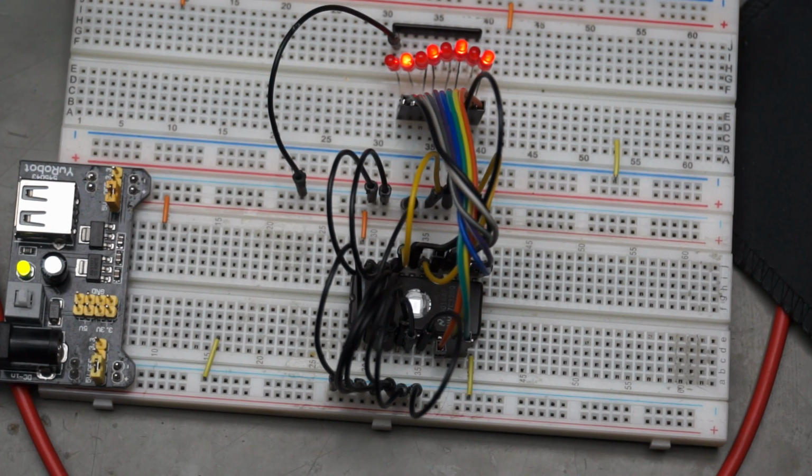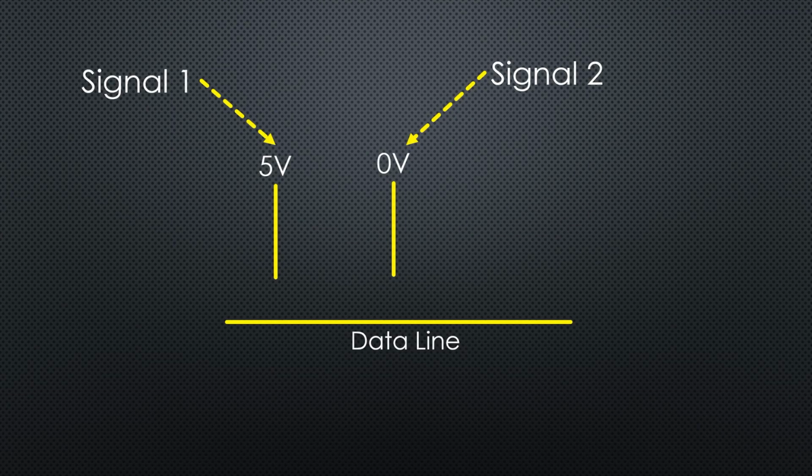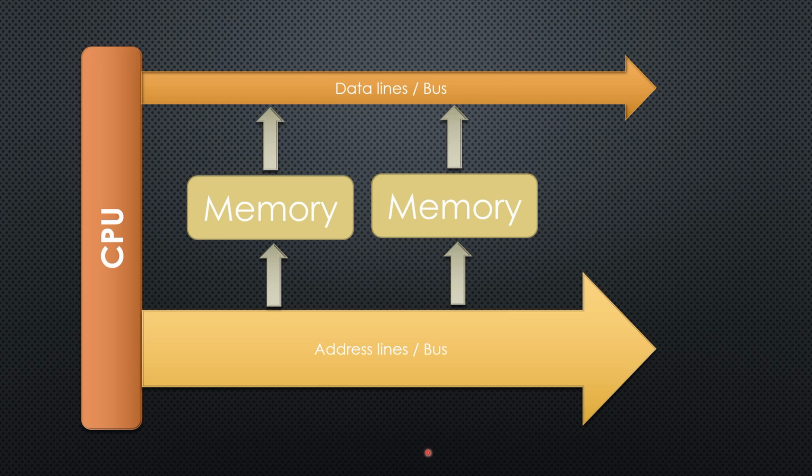These two pins become essential for the next concept we have to discuss. What happens if you connect two wires with different signals to the same data line? Yes, you do not precisely know which one will win. And more often than not, the signal stays somewhere between logical 0 and logical 1, which is forbidden in logical systems. Precisely this situation can happen here.